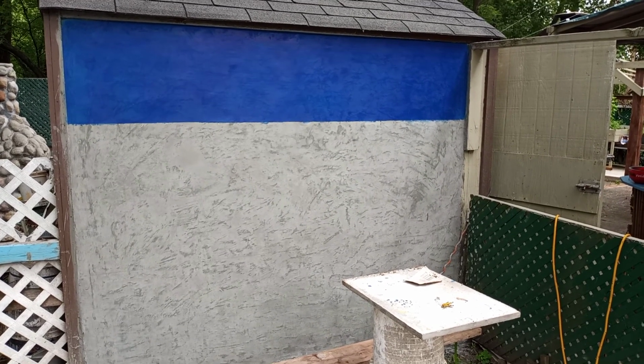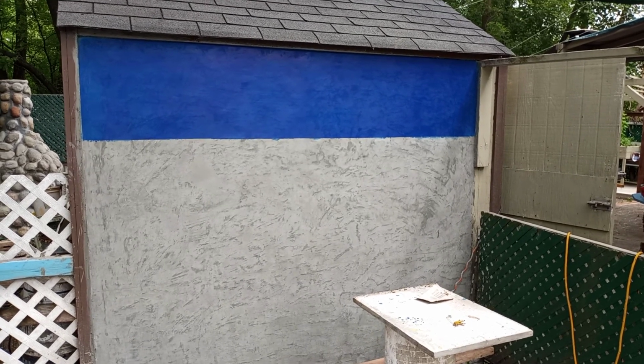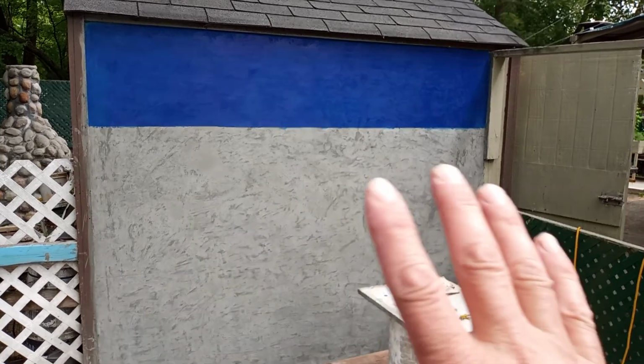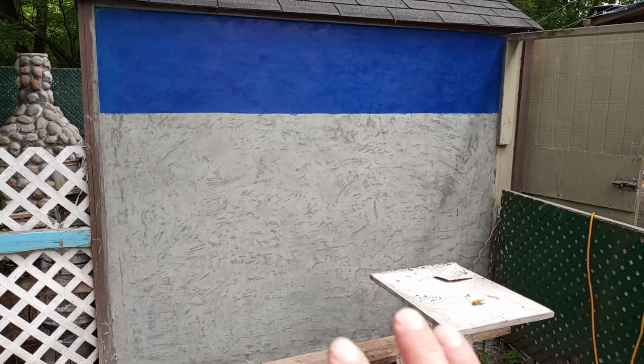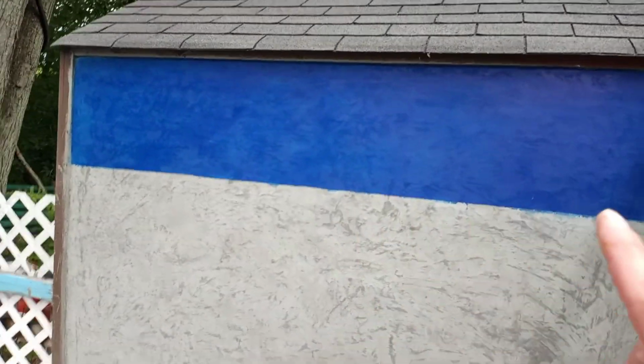This is one of Sue's projects right now. What this is had really bad siding. It's our shed, and we put expanded metal. We screwed to the wood, and we parged it with special concrete. We have all kind of different mixes. Sue's starting to add her color. That's going to be sky, and this is a real smooth mix.